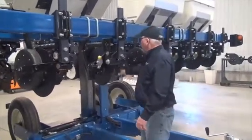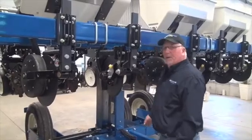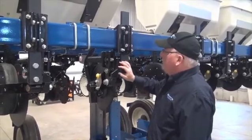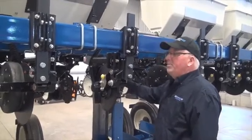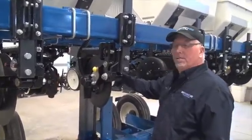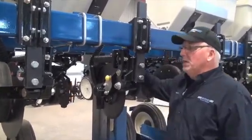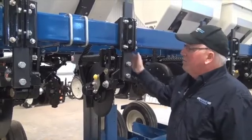When we get back to the planter there's a section with some hoses too, and all planters have it whether they're a central pivot like this or not. Make sure that all the hoses and wiring in those sections are also quite good. On this particular unit we've got a bar out front for the fertilizer — make sure you're checking blade wear on there too. Make sure all the grease fittings take grease. It's a common problem — we get wear three or four years down the road because people have not ensured that the grease fittings take grease in the off season. You're not going to have time to do it in the spring, so make sure you do it in the off season. Check all your springs for breakage and make sure everything is adjusted properly.